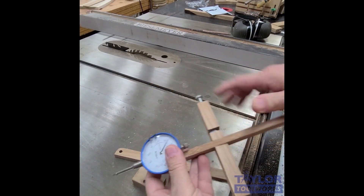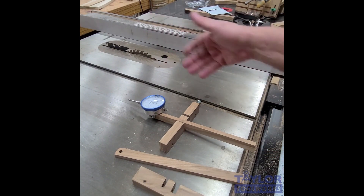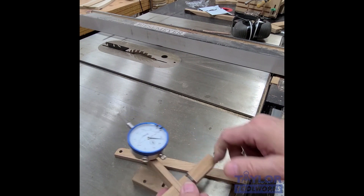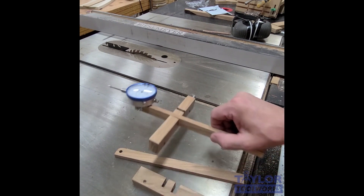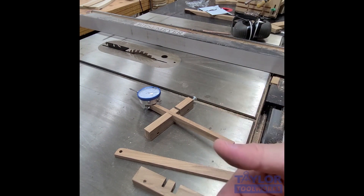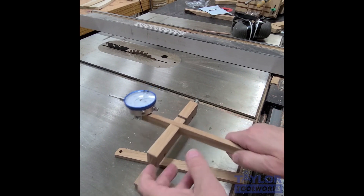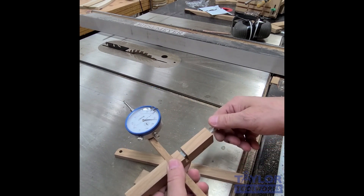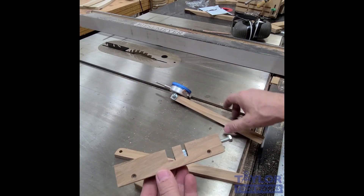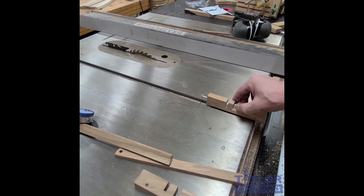This is probably the most important reason to have a dial indicator: to set your table saw fence and blade parallel with your miter slot, which greatly improves cut quality. You can buy jigs for this that cost up to $250, but my advice is don't spend that much on a device you'll use infrequently — maybe just a few times. So I made one. It works very well, is quick to make, and doesn't require any special equipment, tools, or supplies. It simply rides in the miter slot of the table saw.